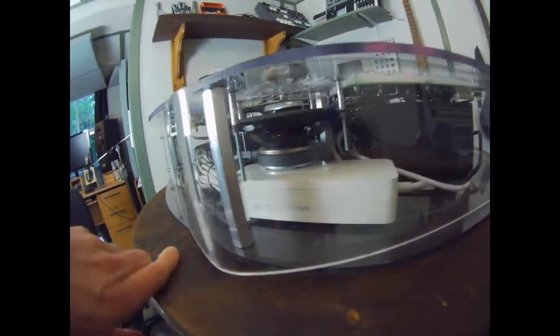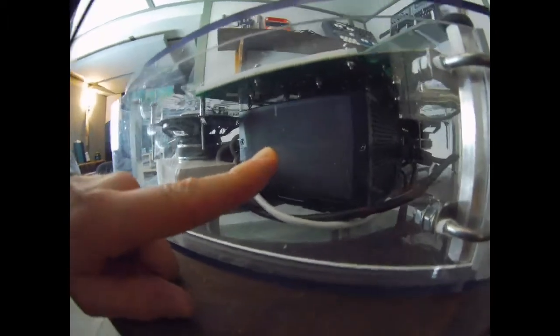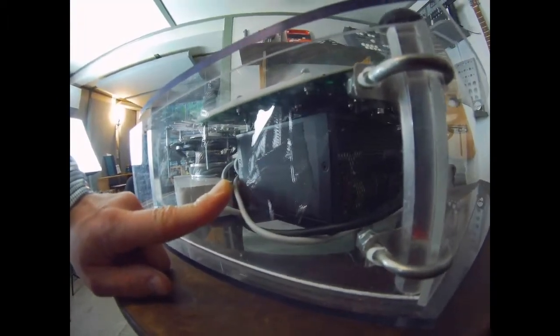I chose a car stereo amplifier because home stereo amplifiers aren't usually very compact or durable. Car and boat components are extremely durable. A cool thing about this particular one is it's a four-channel amp. Home stereo amplifiers are usually just two channels — left and right — so if you've got six or eight different speakers and want to set all their levels, it helps to have a multi-channel amplifier. You don't find six or eight-channel amps in the home audio world, but you do in the car stereo world. It's powering the three speakers in the Mini Masher.